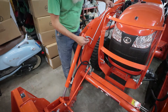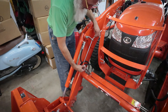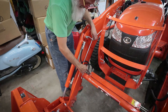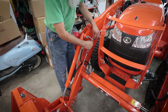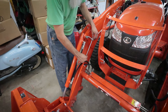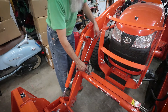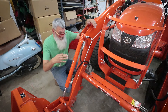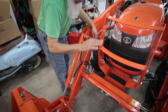The last step: this rod indicator will slide through this, go down into here, and then it locks in place with this bolt. From what I've gathered, we're going to have to fire this tractor up and give it a try. When you're in this corner position, that's where your level is. If you go in either direction, you know you're not level. When you get it right there in the center — and if you have different attachments like pallet forks, things might sit a little differently — you can loosen this bolt and put it on a level surface.